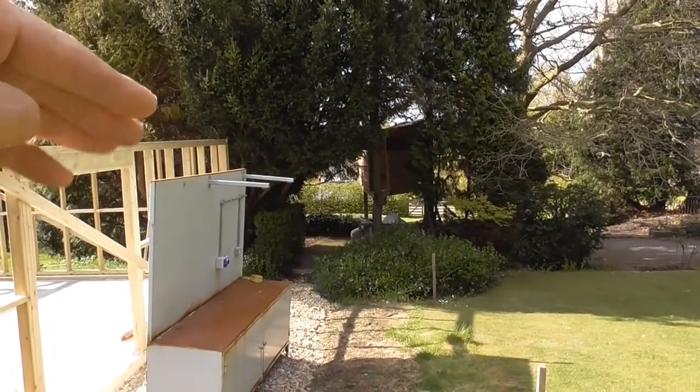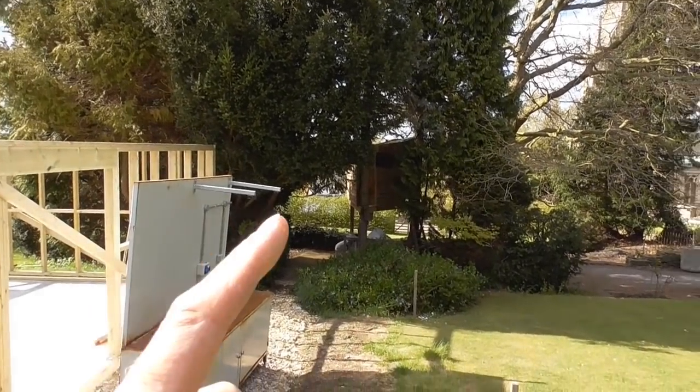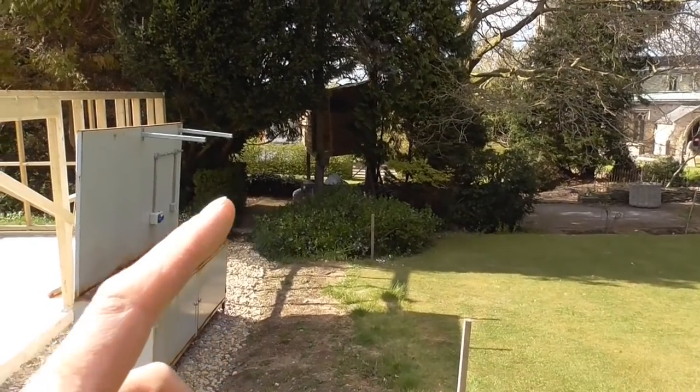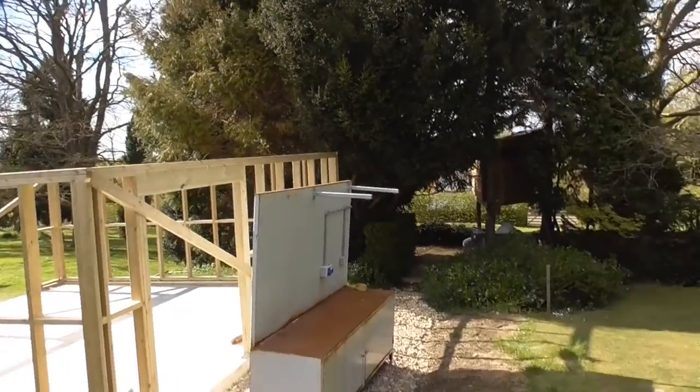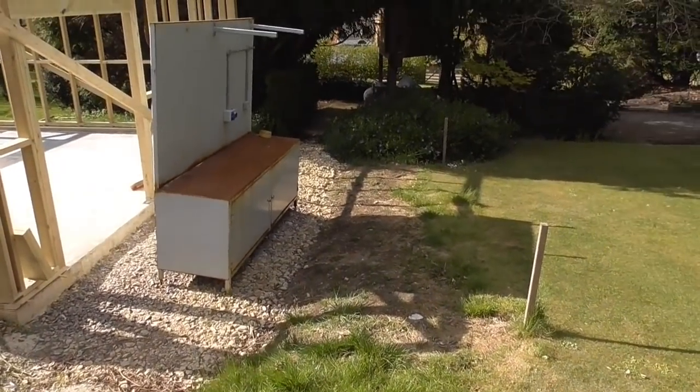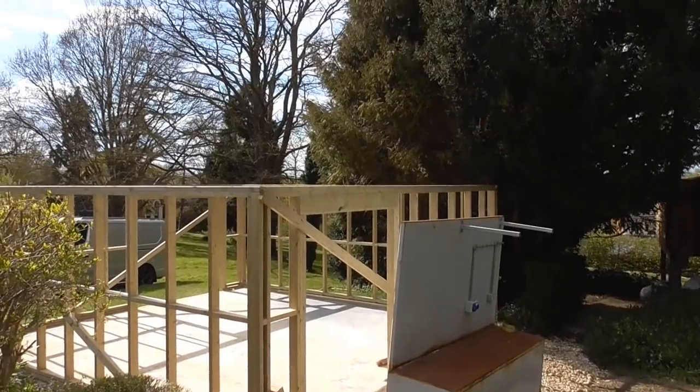Then what we're going to do on here, excuse this bench thing, we're coming out another 3.5 meters. I'm going to make this out of probably some heavy duty posts, maybe oak posts, and pitch another roof up and down, and that'll cut into this main roof, and this will then be a deck area out here. So when it's done, it's going to look fabulous.